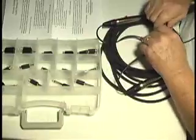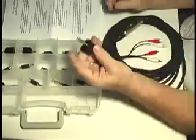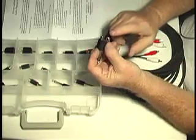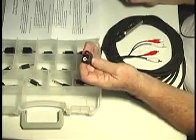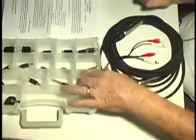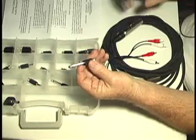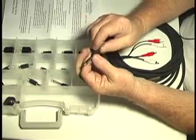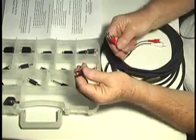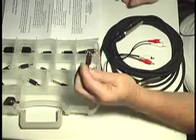I'd like to show you what's in the kit. You have, of course, the 2 main cables, which I've already described. You have this 1/4 inch tip ring sleeve. It's stereo. It comes out on left and right, female RCA. You have 2 of those in the kit. And then you have a mono 1/4 inch, just tip and ring. And then on the other end of that, you have a female RCA jack. And the reason why we're using females is because we use males over here on this end, so that mates it. You got 4 of those in the kit.